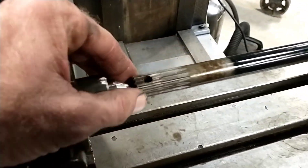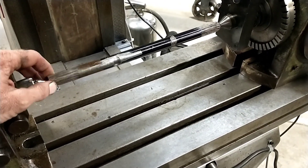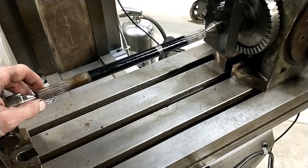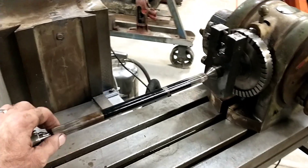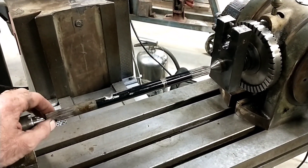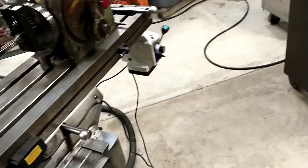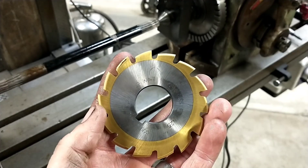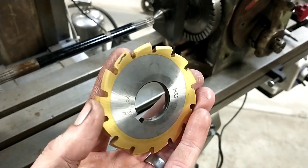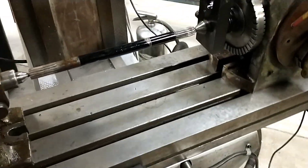Long and short of it, this shaft is worn out. You can see it's really chewed up here and there's some serious wear in the spline. These parts are not available. When they first contacted me about doing this, I suggested they go to a gear and spline shop because it's kind of expensive tooling up for this and a lot of horsing around to get it to work. But they took it to some kind of spline shop and they quoted $2,000 to make this shaft. I agreed that was pretty outrageous, so I said if they'd buy the cutter, I'd have at it. After talking to Ash Gear and Supply - they did some number crunching, took some dimensions - they told me this is the cutter I need: a 24-48 involute, 30-degree pressure angle. I've laid it in the spline teeth and it does look correct.